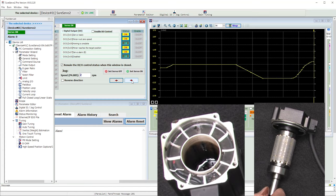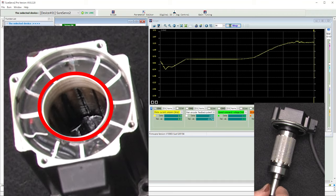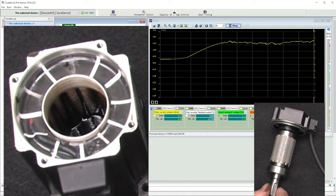Now I'm going to attempt to hold the jog button down and rotate the rotor at the same time to simulate what the drive would normally be doing. As I do that, you can actually see the stator magnetic fields rotating around. And that's the beauty of the three phase AC input to the stator – the drive can smoothly move the rotor to any position simply by adjusting the currents at each of the three phases to create whatever magnetic flux it needs on the stator to move the rotor wherever it wants. We call that synchronous because the rotor is always going to follow the stator's magnetic flux exactly, unlike asynchronous AC induction motors where the rotor always lags the stator flux. Now, adjusting those currents requires a phenomenal amount of processing – basically all the stuff in the current loop block – and all of that is helped by the high bandwidth and extreme resolution of the SureServo 2 system.